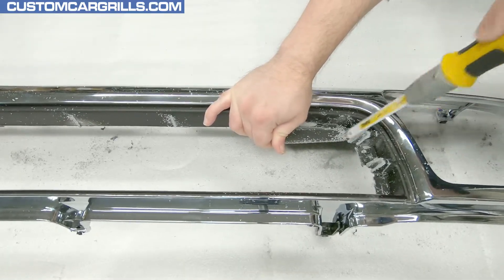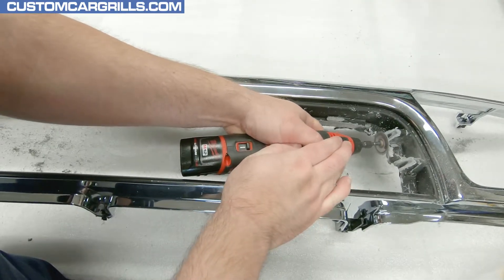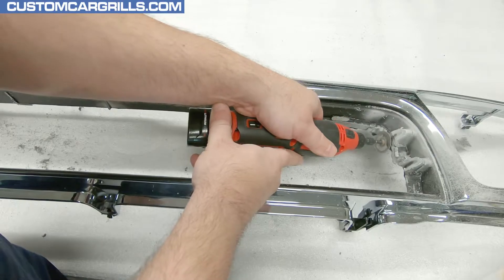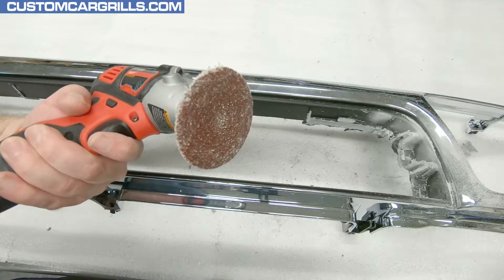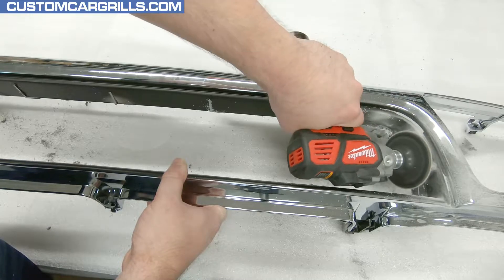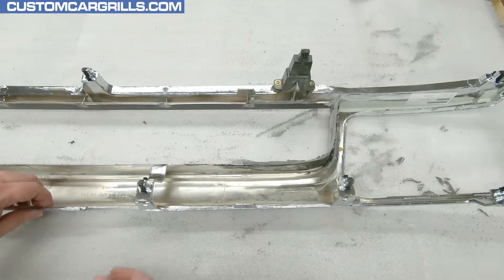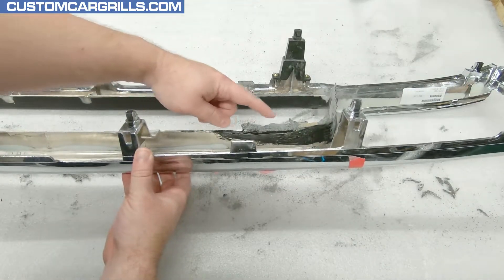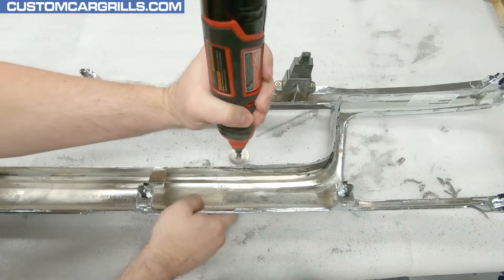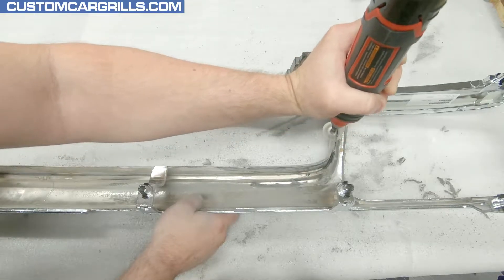From here, it's just a matter of refining the cuts down further and further to remake the outer edges. The top of the shaping wheel is very abrasive and can work fairly well with knocking small sections down. Having a 3-inch sander like this is also great for getting larger areas done in a timely manner, though it's a little too bulky to properly get in all the areas. Now is also a good time to cut and shape the back edge of the grill — the repaired edge is sticking out a fair bit past where it should be, so I'll simply trim off any excess.